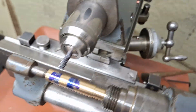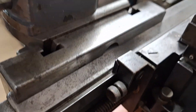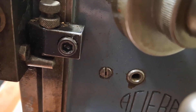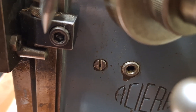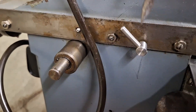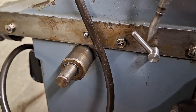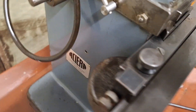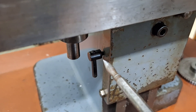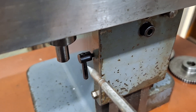We've got stops on the traverse - nice little adjustable stops - and I've set those on both sides. I've set those for my limited travel. There's a stop on the knee also, set to give three mil depth of cut on each side. There are locks: a lock for the top slide, a lock of a different form for the traverse - a rotary lock on that one - and you can just make out the lock for raising the knee.